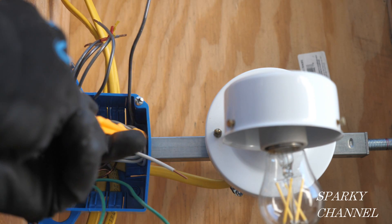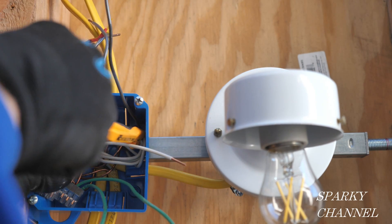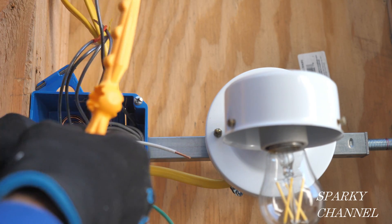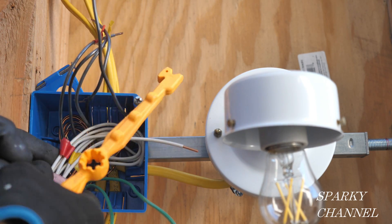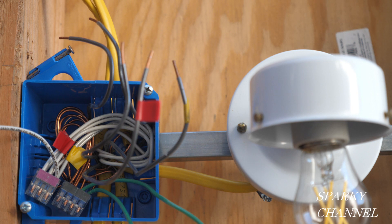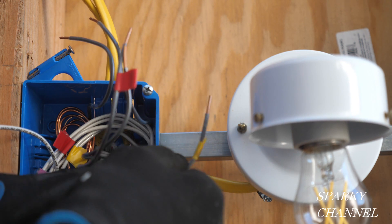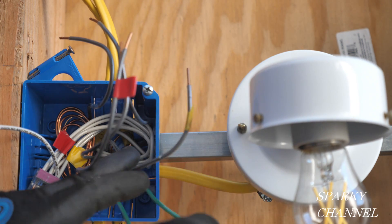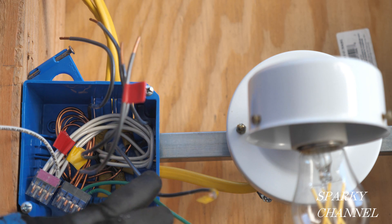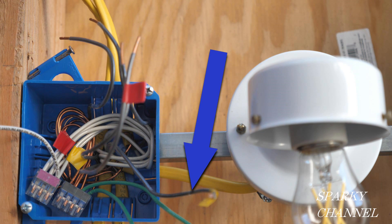Here I've made my preliminary bend up into the upper right-hand corner and down into the lower left-hand corner, and I've got my little volt claw. This is a tool that my friend Warren Tarbell invented — he is a master electrician. It's just a nice little tool to help you push the wires neatly back into the back of the box. Now it's time to work on the hot wires. The hot wire with the gold tape is the one which goes to the light. We will connect this wire to the right side of the switch as you will be looking at it — it will be carrying the current in a switched manner to the light.